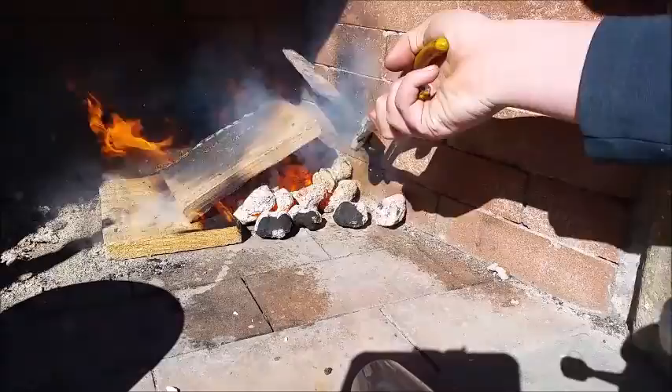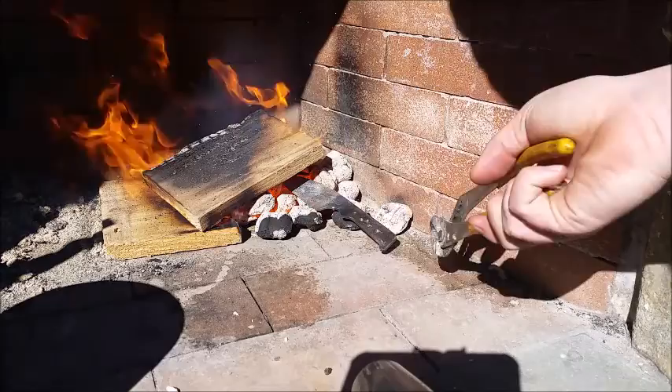Here in the video you see me testing the knife with a magnet. When the knife is no longer magnetic — so the magnet doesn't stick to it — stick it back in the flame for a little bit longer.